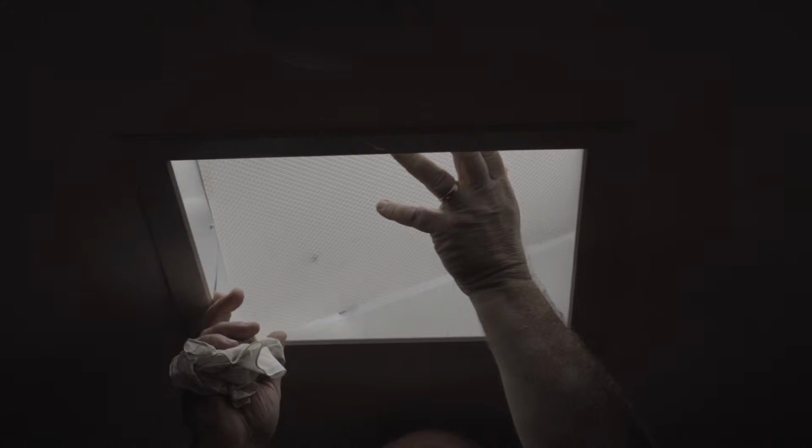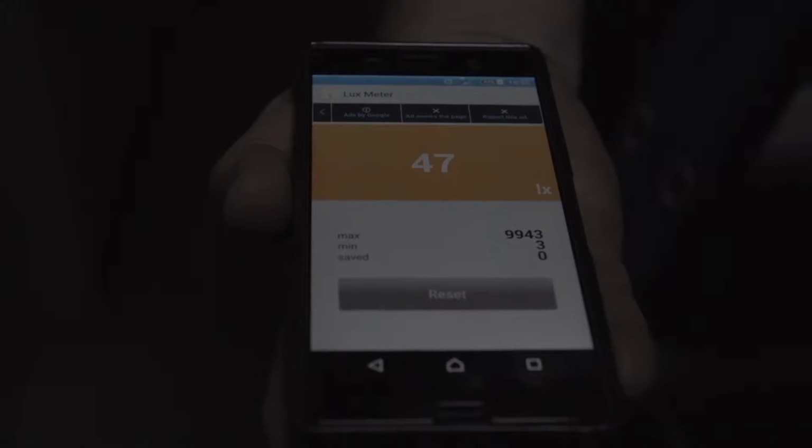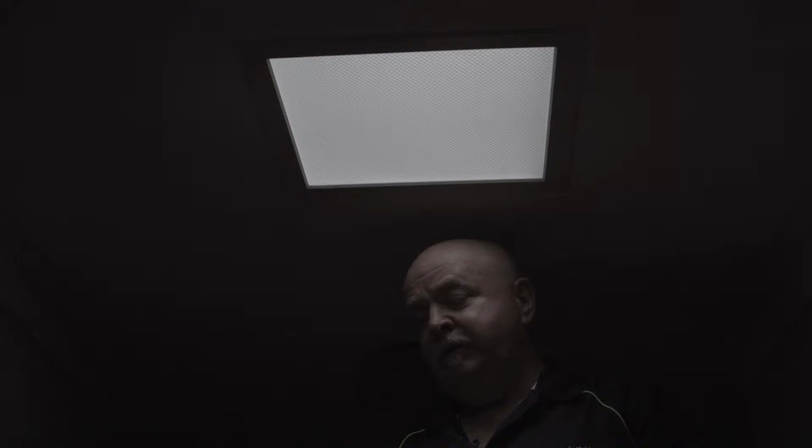We're looking at the second skylight in this property. This one's in a passageway. It's a 400 by 400mm traditional square skylight. At around about 700 from the roof, we're only achieving about 120 lux with this skylight. It's got a drop of about 2.5 metres.